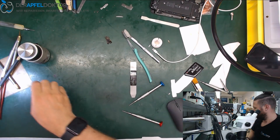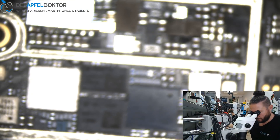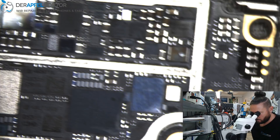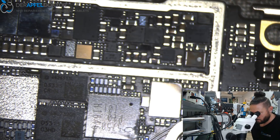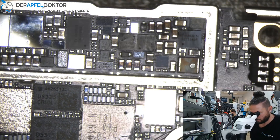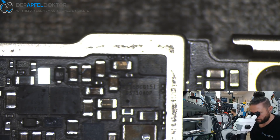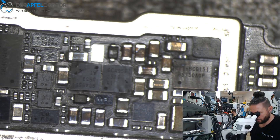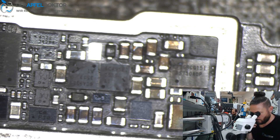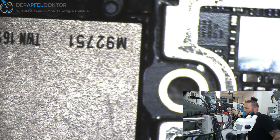Do visual inspection — perhaps we can see something. It's a rainbow colored one. What's that here on the bottom? Do you see that? Looks like corrosion — corrosion on the backlight ICs, on the LCD IC. Yes, it's corrosion.